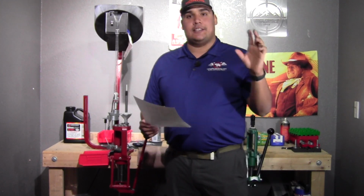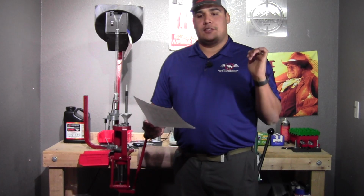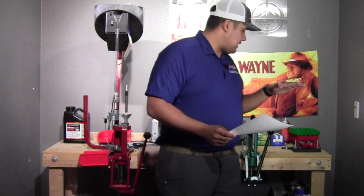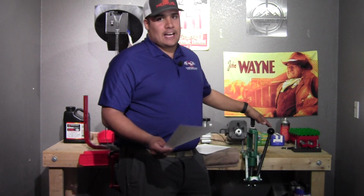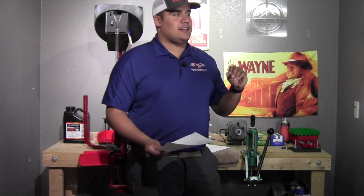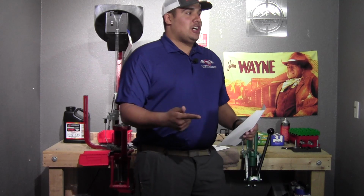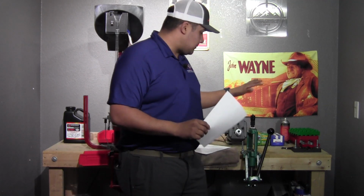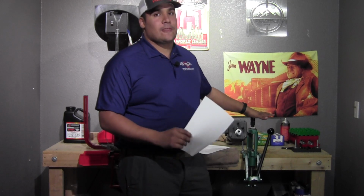So actually what I did, I took the 20 rounds that I randomly picked out of the box of the single stage. I came back in here, moved my micrometer die down another 6 thousandths and reseated those 20. Okay, actually 25. I wanted to be prepared. I seated 25 in case I just had a crazy flyer, had a dud, had a speed mess up, whatever. So I came in here, bumped those 25 down 6 thousandths.